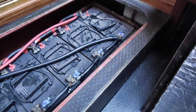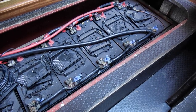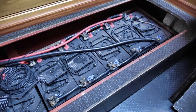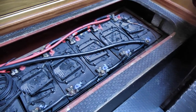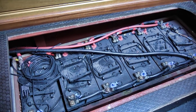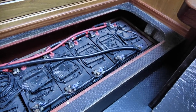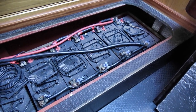These are our batteries - we chose gel batteries and these are dual purpose. We've got six at the back at 115 amp each, and two at the front again at 115 amp each for the bow thruster. We chose these because they are long lasting and really good value. We thought long and hard about lithium, but there is no way on this earth that lithium is worth the money at the moment.